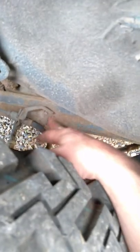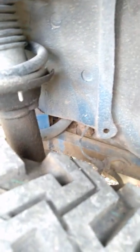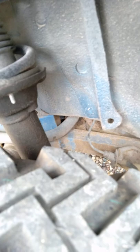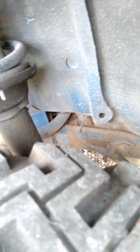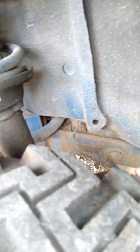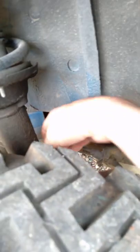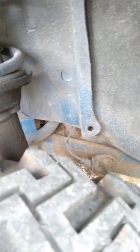The rear half of the car — the frame came up and I tack welded the brake bracket onto it. That was interesting running all the brake lines through, re-running them. The foam keeps them from vibrating. That's the air breather hose, and that keeps it from vibrating and getting on any edges — that was cleaned up so it's not sharp.